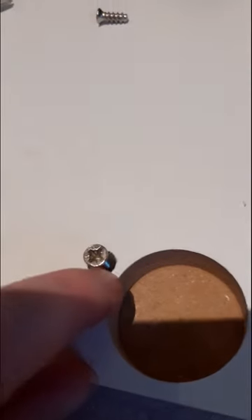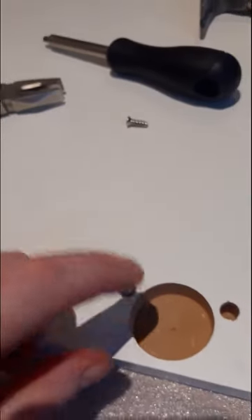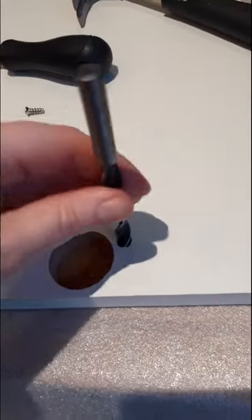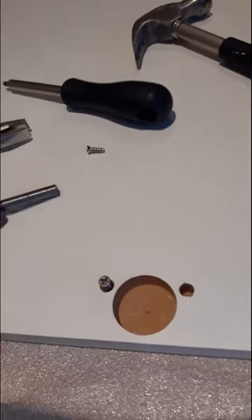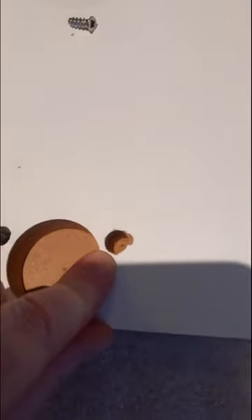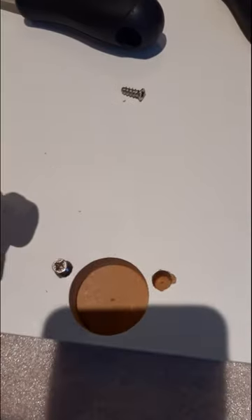However I still think it's too tight because it's starting to crack here, which I'm not overly happy with. So my next step is to get an 8mm drill bit which fits nicely in here but it's a little bit snug. I'm just going to attach that to my drill and drill in a couple of times to make this hole a little bit wider, and then hopefully my dowel will push in a little bit easier. When I put the 8mm drill bit back into this hole it still didn't really fit, so I put the drill bit back in and wiggled it around - probably not the most professional thing to do, but it gives a little bit more clearance. Now this should fit in quite nicely.